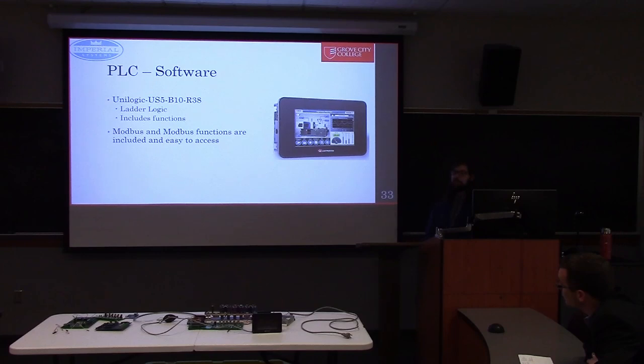Hello, my name is Samuel DeSanto and I was the PLC personnel. The PLC here — the US5 as we call it — is a Unitronics PLC running on UniLogic, a ladder logic programming language. It uses blocks to simulate code and rungs to implement it — if there is a direct contact like a button press, it goes down the line on that rung. It includes more advanced functions beyond ladder logic, and it has Modbus functions that are very easy to access.